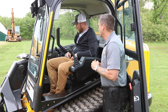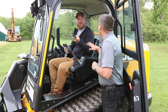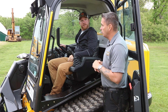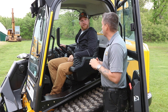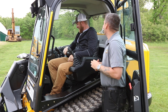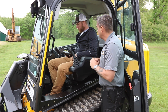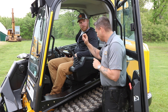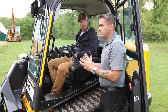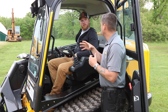Safety features include a seatbelt on your right hip. The machine won't shut down without the seatbelt — it will operate without it — but there are two required safeties: the left-hand pod and the right lap bar both have to be down. At any point during operation, if either one of those jumps up even slightly — for example on bumpy ground — it will automatically put the machine into park.